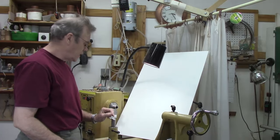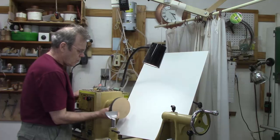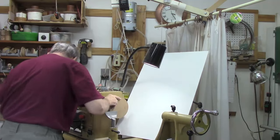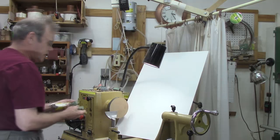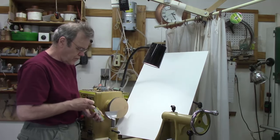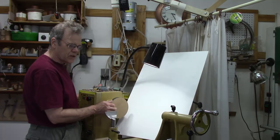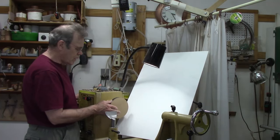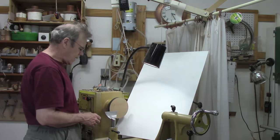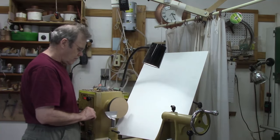Here are a couple little sharpening jigs I've come up with. I took a threaded glue block and glued it onto a piece of three-quarter inch MDF, turned it round. Now I have two pieces of compound — this honing compound. You can put a little of this on here and this thing works great for really honing chisels, bench chisels, your woodworking chisels, and it also works well for your skew. What I do is reverse my lathe, turn the speed down so it's coming away from me, and I can use it in this manner to hone and get a really nice sharp edge.